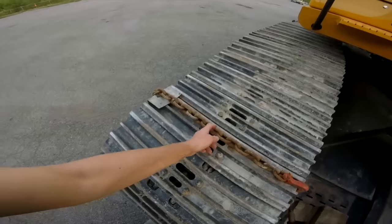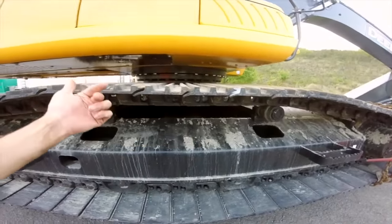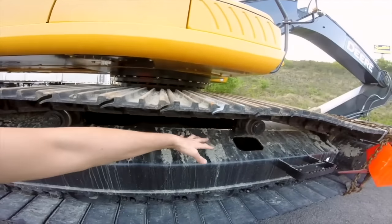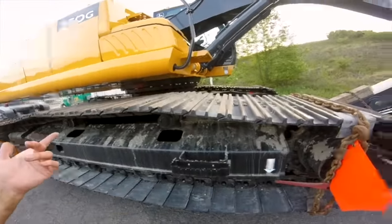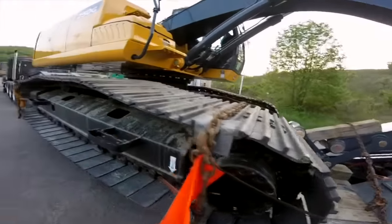One thing I learned with these machines and one thing I recommend: do not put a chain in the middle. I did it on my previous excavator - you'd think it would make sense, just one pair of chains, because this is only about 52,000 pounds. But it's gonna start sagging because there's no support there. You start chaining down and these tracks start wiggling, so instead of one I use two chains.